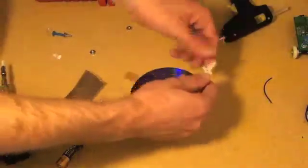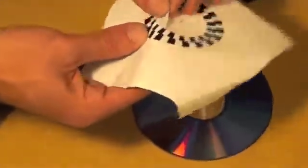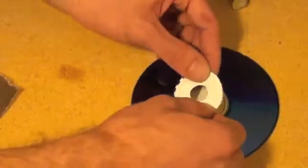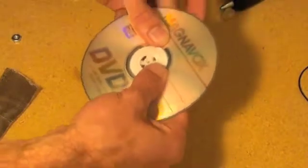After that's roughed up, clean it again so you remove any oil or grease. You want the largest servo horn. Stick the largest servo horn in so that the splined hole is facing down when you're on the shiny laser side of the board. Then remove the small doughnut and use it to hold the horn centered in the hole — just line it up and get it nice and centered. That little doughnut will hold it in place for you.